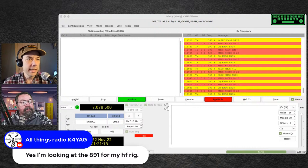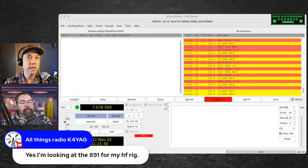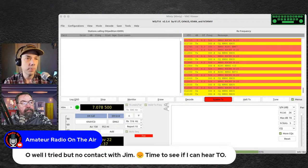So he's looking at an 891. That is a fantastic radio. You will need an external sound card in order to get onto FT8 with that radio, or an external sound interface cable, and maybe some noise reduction type stuff, depending on your computer setup and your environment. But definitely message me on Toads, message any of us on the Toads Discord. Again, there's a link in the description below, and we'll get you all set up with that radio, no problem. Because I have one. It's a fantastic radio. I've had one. It's a great radio.